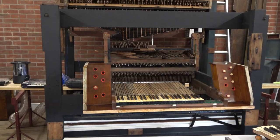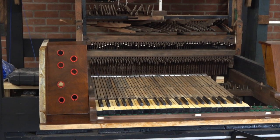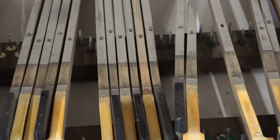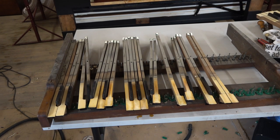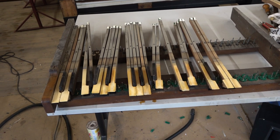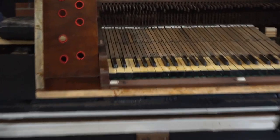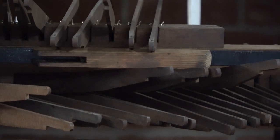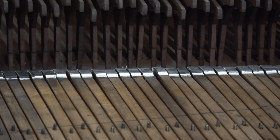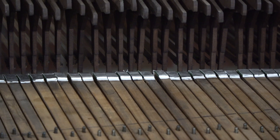We'll put the camera on when we get a bit further. With the bottom keyboard in position but not all notes in yet — they're still being clamped to have the back leather done — I've now got the other keyboard out of storage, and that's going to want exactly the same treatment. It's the top keyboard we want to get working first because the soundboard and equipment we've already installed is for the top keyboard. Right up there are the backfalls for the great — the bottom keyboard — so there'll be trackers between there and the leather at the back of the keys that I've put on. There's also a register which holds them in position, and that's really the next thing to go in. I'm just going to start on this keyboard to get some keys clamped and not waste the one remaining clamp tonight.